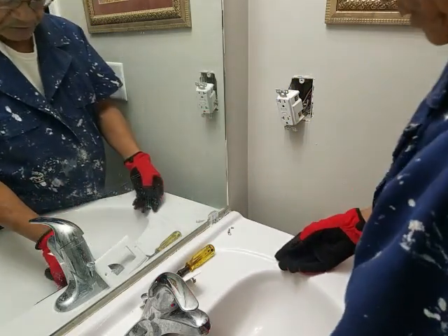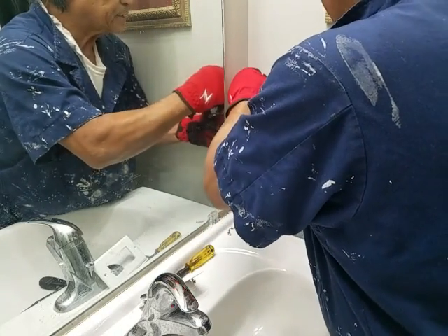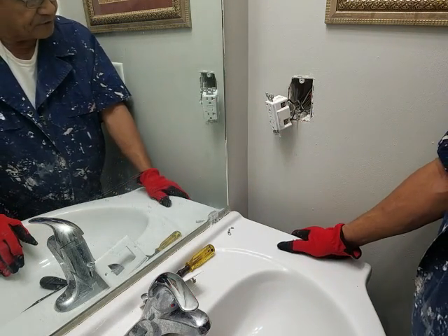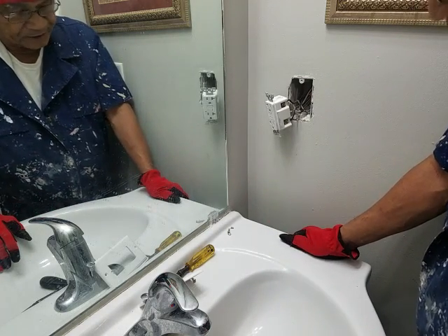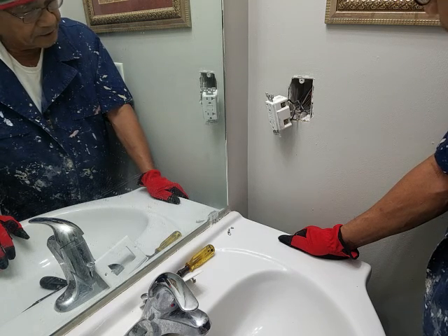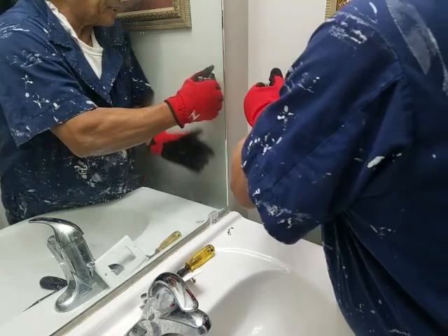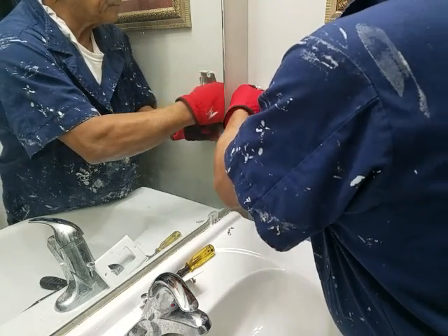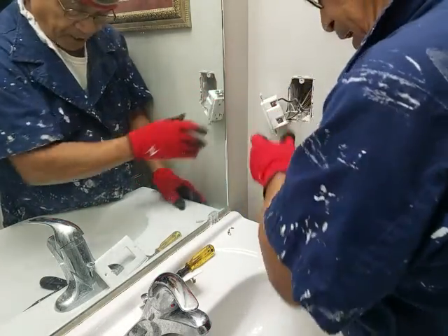See all these receptacles here. Don't just remove these wires without having your new one so you can compare from the back. These are bathroom GFI — ground fault circuit interrupter. When something gets wet near your receptacle, this will trip. It's a lot more sensitive than that circuit breaker out there because this is mostly for water protection. They also have a different GFI on the outside outlet.